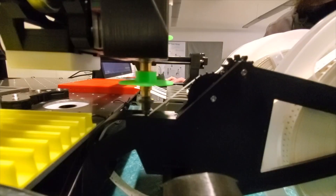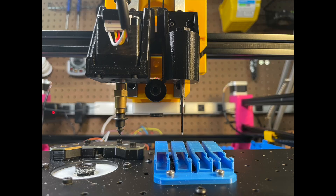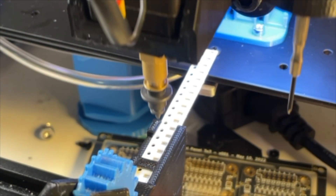But so far it's a super good sign. The community has been totally running with it. Also from Discord, Cordy Moto has a design that's similar to this and it looks great and works super well. Jazzy Chad has actually added a peg to the second head of his machine, and that's what's used to move the tape forward so it's not putting that much force on the nozzle tip. Many pick-and-places actually have a solenoid with a pin that's used to do the same kind of thing.